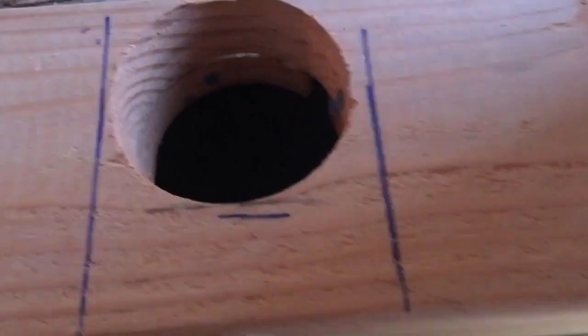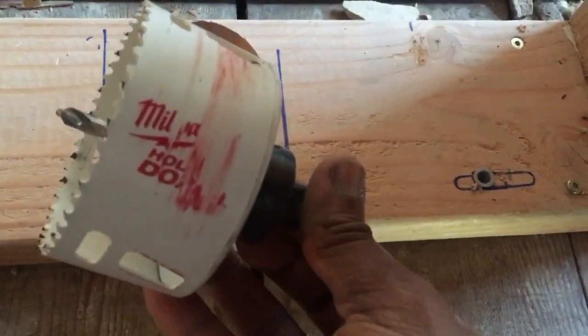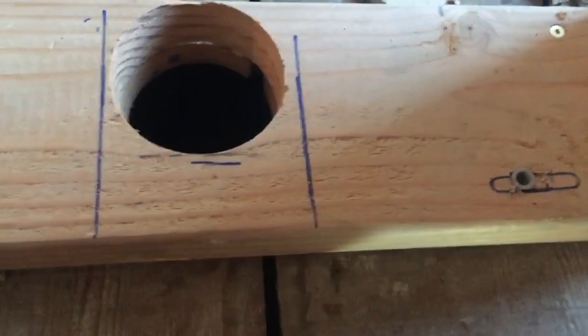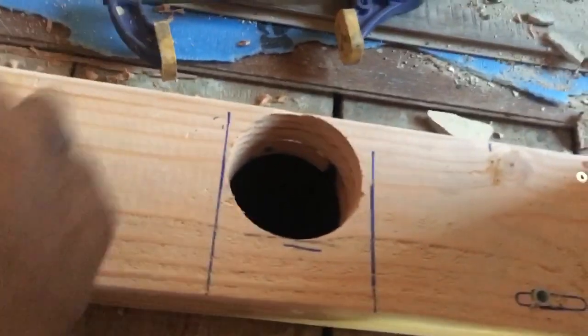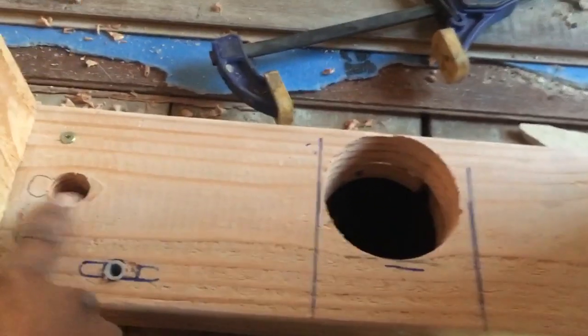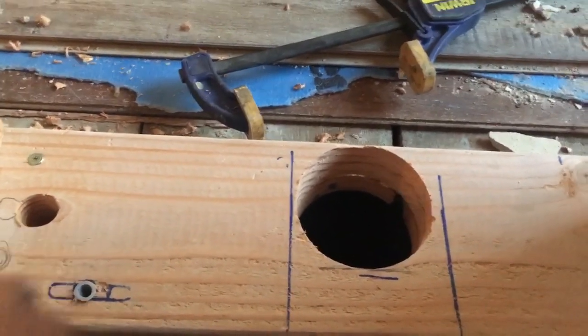I can't really see one from the other side, but I need to make sure I had clearance for everything. So, a 3.5 inch hole saw, cut all the way through. My 2x6 framing here, supported to the floor. And this part here is about 9, maybe 9.5 inches to the left. This is going to be for a 1/2 inch PEX pipe.